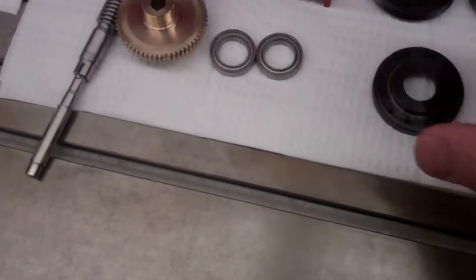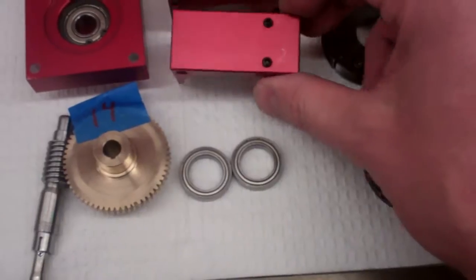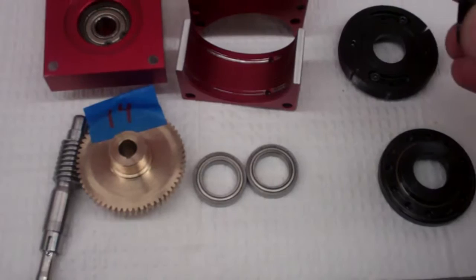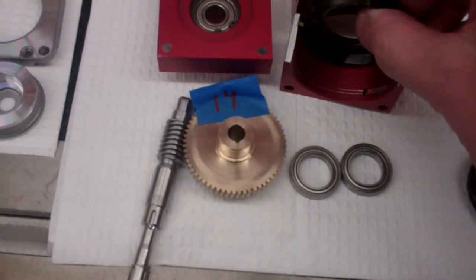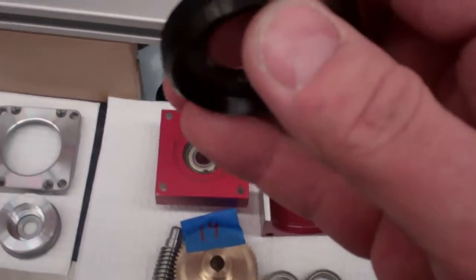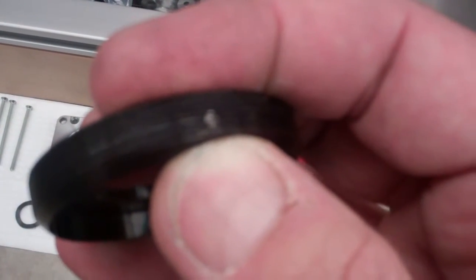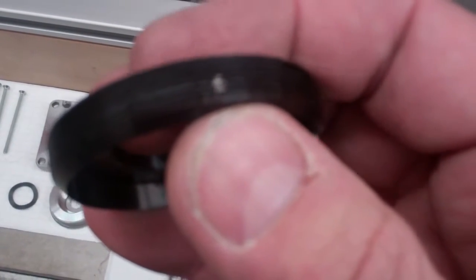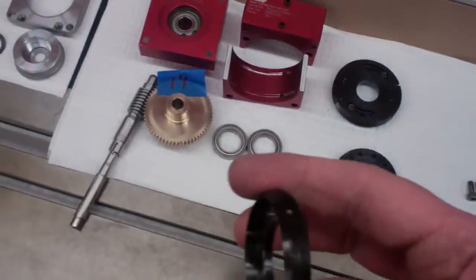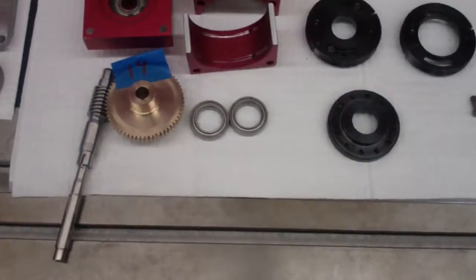So like I said, these are factory set up and they really shouldn't be messed with. Once they are adjusted, these set screws are tightened down to hold the threaded pieces from coming loose or moving under vibration. And once the set screw is tightened down into this, it kind of boogers up the threads, as you can see right there. So when you try and take one of these apart, if it's not lubricated when you go to remove these pieces, sometimes it will try and chew up and gall the threads on the aluminum, and it will put up quite a fight to be removed.